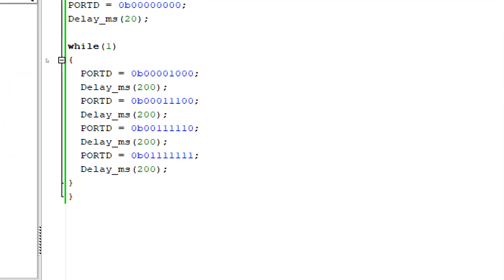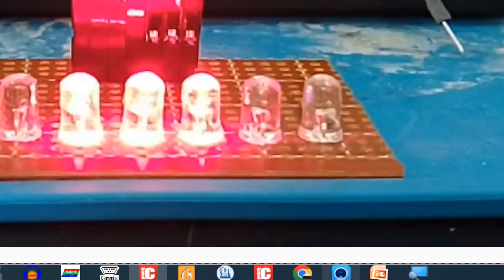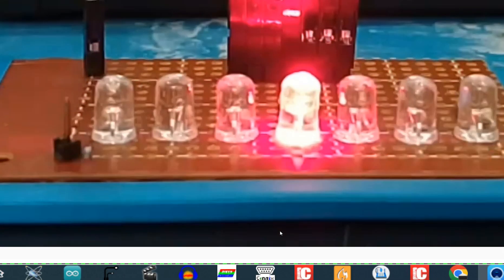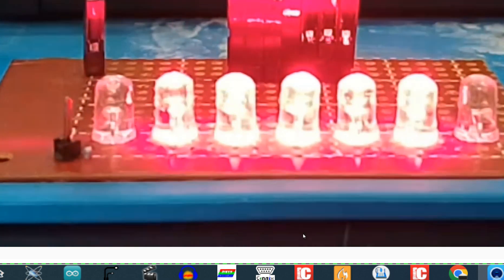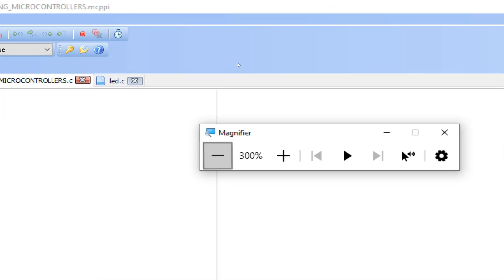Let me zoom in again to see what we had done. We had turned on the center-most LED — I sent a one there. Then we turned on one LED on each side — that's what happens in the second step. The center LED turns on first, then one LED on the right turns on, then it expands on both sides. That's how you can make sequences easily using this bit technique in MicroC. In the fourth step you turn on the extreme left and extreme right. Then all LEDs are on. After the repetition, zero is sent again — only the center is on, rest are off.